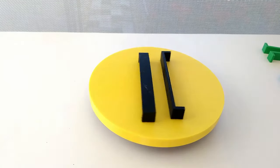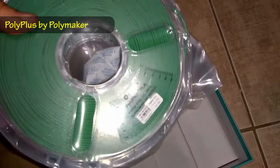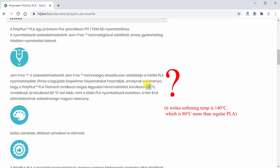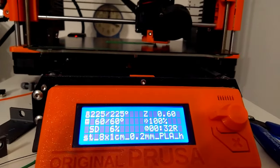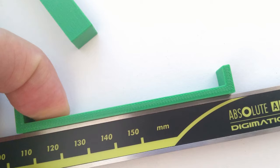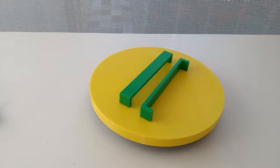The third PLA in this test is Poly Plus by PolyMaker — its new name is now PolyLite. On the local store it says it can hold up to 140 degrees Celsius, which is ridiculous — I know this is again some kind of marketing data. I really like the PolyMaker brand because I know they have good quality filaments, but according to the data sheet the heat deflection temperature is between 50 and 60 degrees Celsius. I have this filament only in green color so I don't need to mark it.